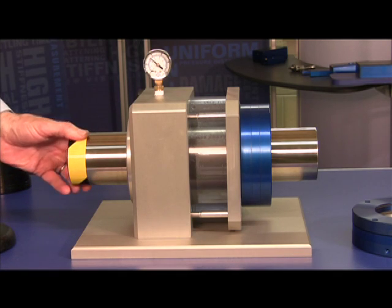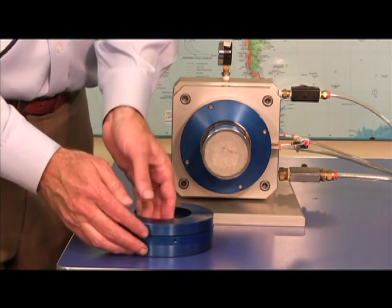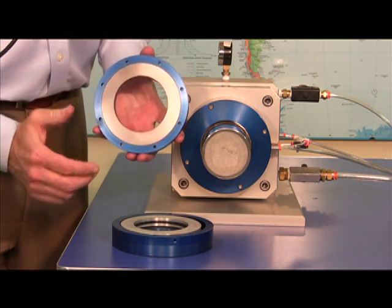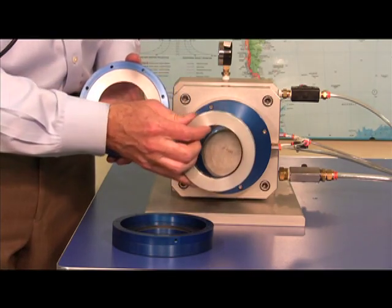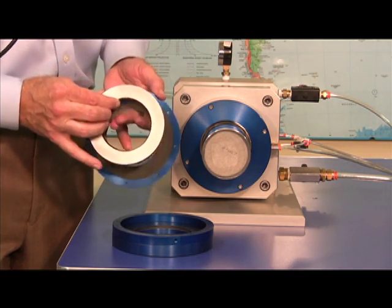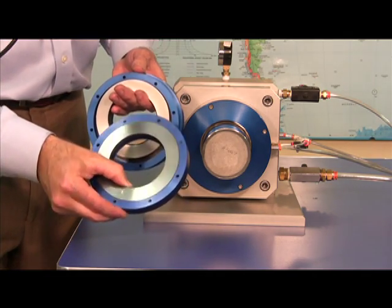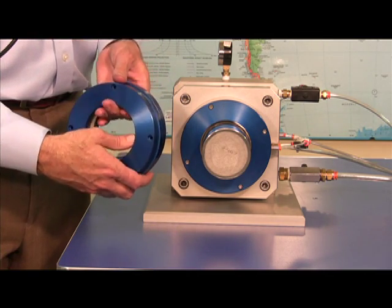This is a very effective non-contact seal. So what's inside of the New Way air bearing seal? First, we have a flange air bearing that's mounted in a housing — this would bolt up against the gearbox or casing. Then we have a runner. The runner has an O-ring on its inside; it pushes over the shaft and spins with the shaft in a non-contact relationship with the air bearing face. We have a spacer that is made just a little bit bigger than the runner in order to create a clearance between the two air bearing faces. Then you've got the other air bearing in the cap that goes over the top. Those are the main components of the New Way air bearing seal.